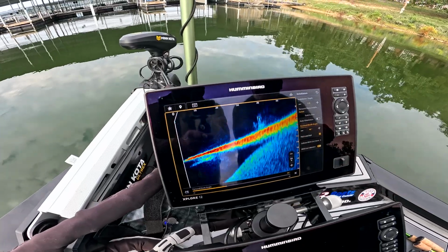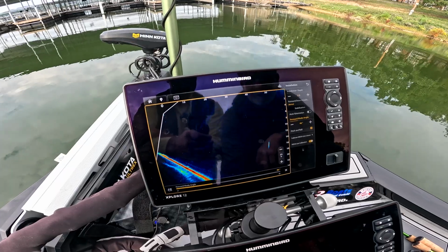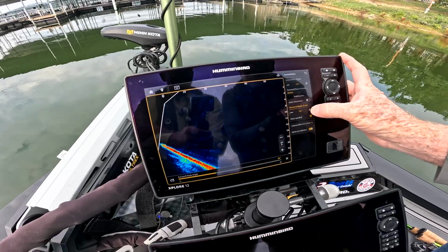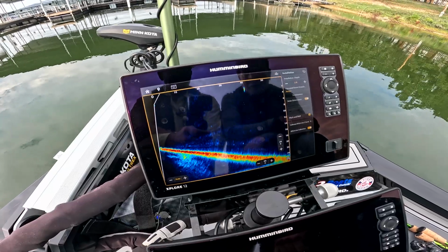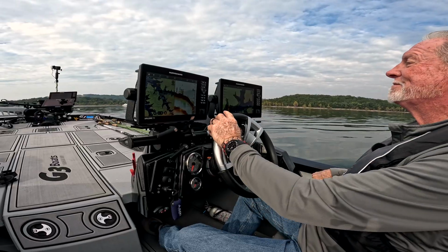And what you talked about on the transducer, deeper water around the 40 and the shallower water more closer to 60, right? Again, depends on the angle of the bank. See now what we've got, we're seeing the down slope of the bottom itself. So now by going to auto orientation, which most people are going to use, it's going to adjust that for you, regardless of which direction you go.